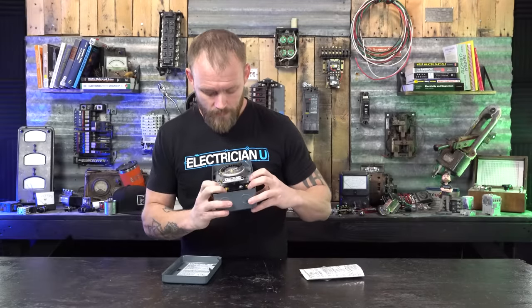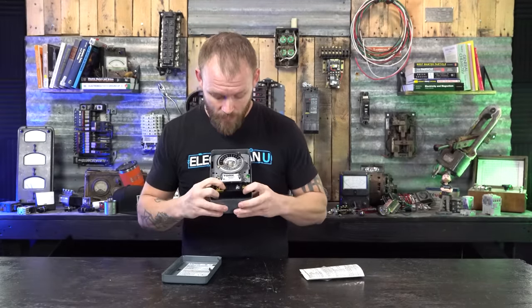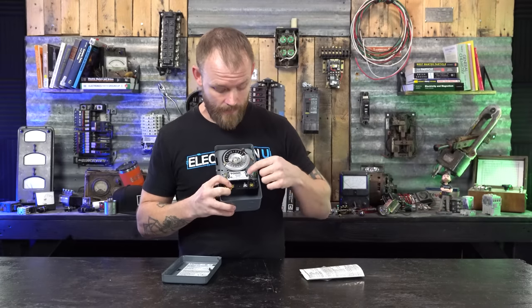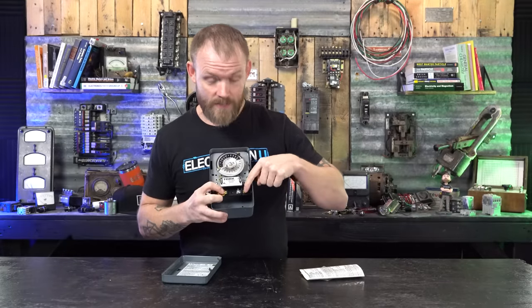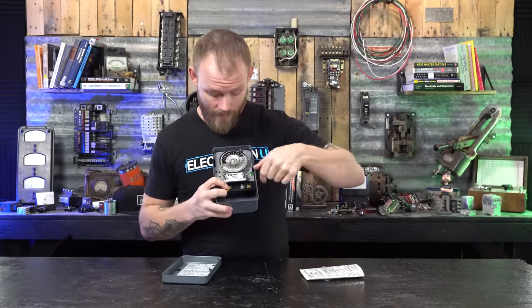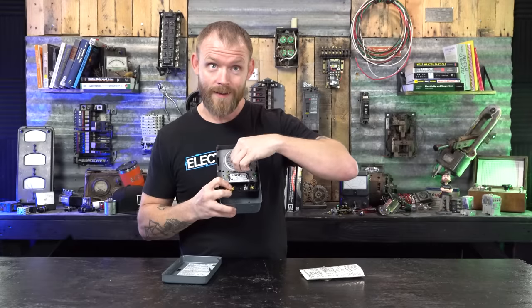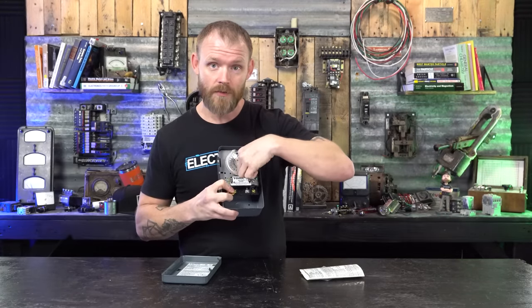But you're gonna hook your X2 up to your leg. So essentially you're getting power here and here. That's just running the clock. And then when the time turns on, or when you're trying to turn the lights on, as soon as this thing turns on, because it's spinning, it's gonna power this terminal. It's gonna send power out. And then once the timer gets all the way around, you can hear it. Every time it spins, turns on, turns off, turns on, turns off.